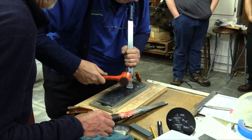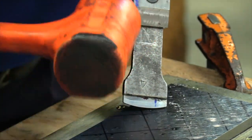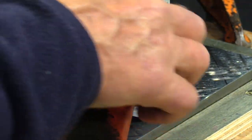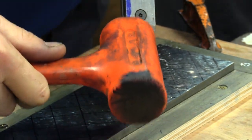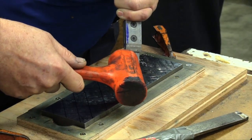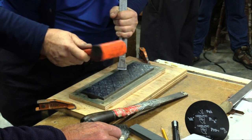Oh, it's not a very hard hit. So that, I'm hitting it right here, see? Yeah. I think hit this corner on that corner. You get a lot more than one. I'm not hitting it straight. I'm hitting it like I said on the hammer. I got this here. So imagine that the finish nail is sticking out like this. Yeah. Like on an angle. But you're not going like that. You would bend over the nail. Right. And so you're hitting like you're gonna hit something in the belly. I think that's something also like the more. You need to put some ink on there too so you see how you're doing it. Yeah, make it really dark.